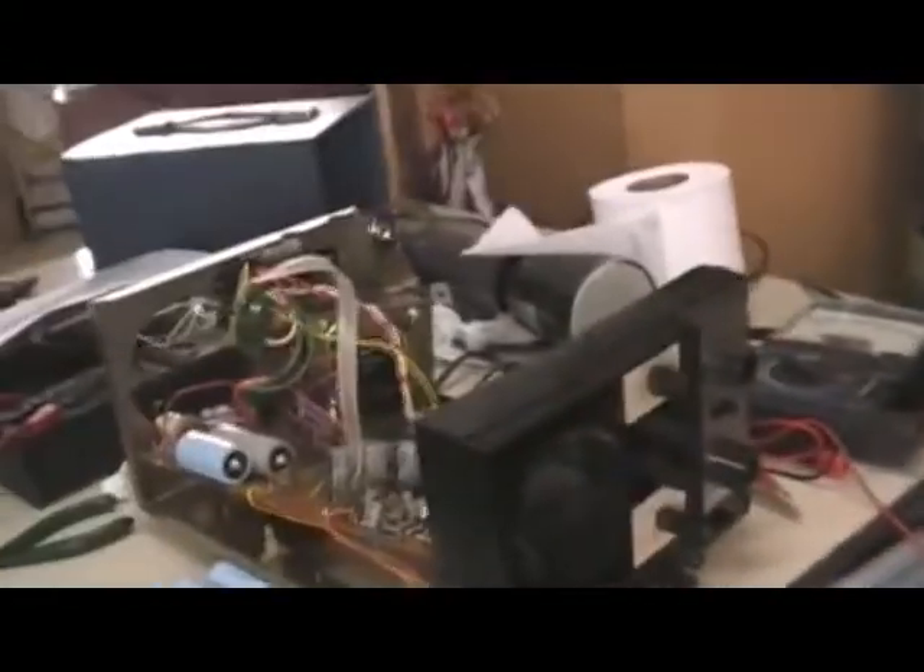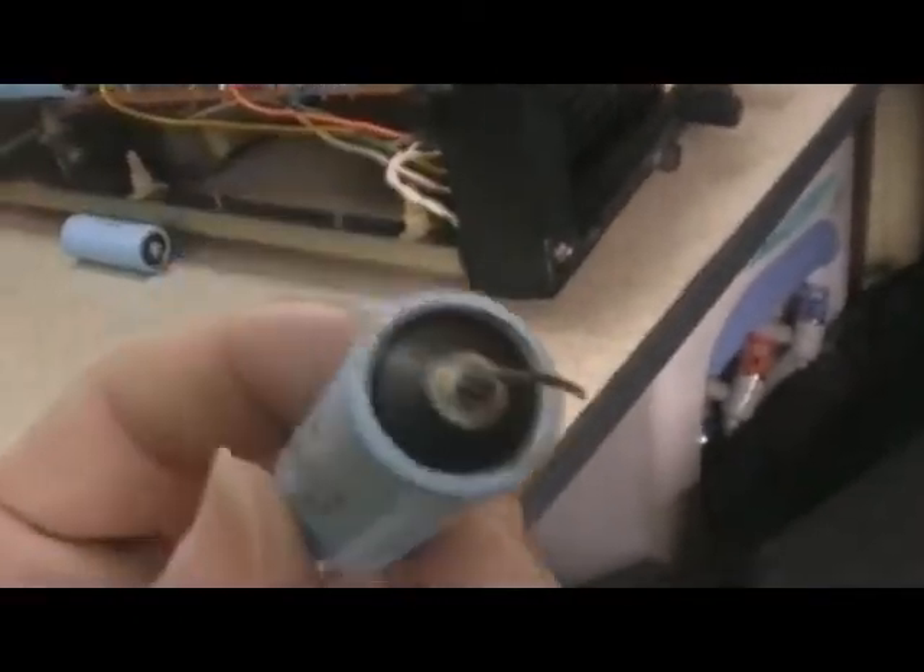This is 0.5 volts — hold it, 0.5 volts. This Radio Shack probe scope is made in... Anyway, nothing beats the old vintage cathode ray oscilloscope. The very common problem with old vintage equipment is the capacitor — there's an electrolyte inside that tends to dry up or leak out. I just need to buy the capacitor and it'll be back to original condition.